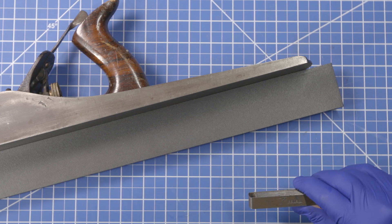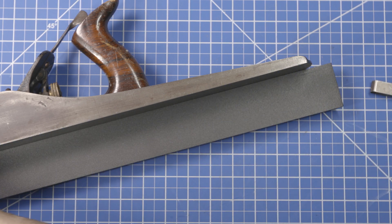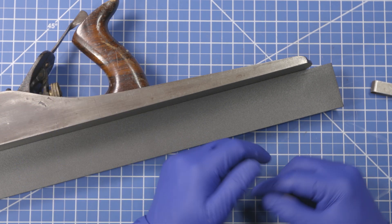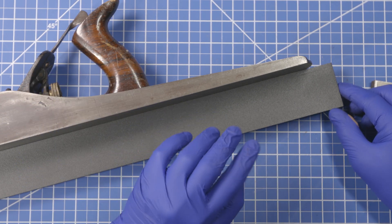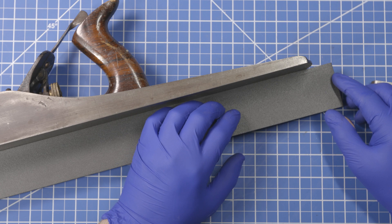Which can be flattened out, but it's a bit of a pain since you need to take out all the other metal to get to that. But this is iron, so it'll come down pretty quickly. That is how you use a precision straight edge to determine how flat flat is. Until next time, this is Just Tool Basics.